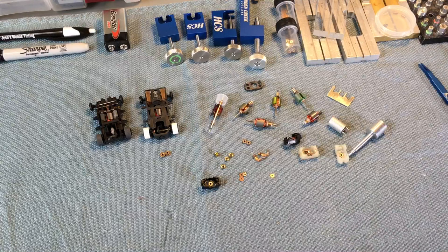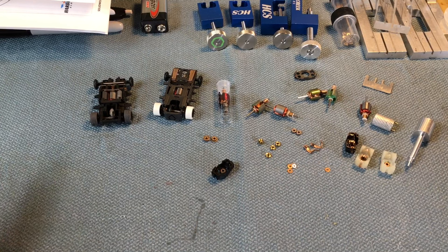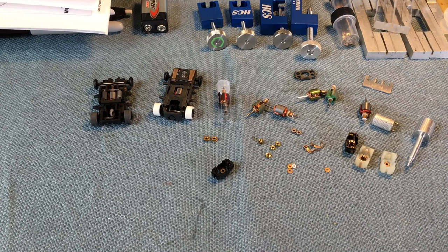Let's dive into armatures. Last episode we talked about motor magnets and traction magnets. We'll talk a little more about motor magnets because they have direct bearing on an armature, and vice versa. An armature is essentially an electromagnet. The internet is full of resources on the means, methods, and functioning of a DC armature. Ours happens to be a three-pole motor — other more complicated motors may be five, six, or ten poles. Three-pole motors are very common, even in the larger scales.